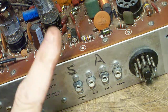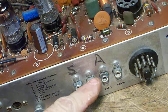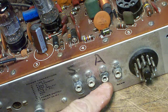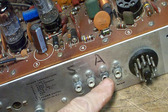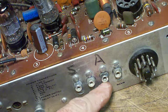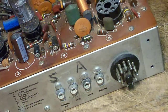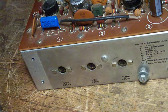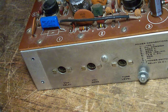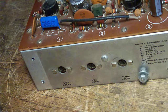Now let's talk about the hookups. You've got your speaker which is an RCA jack, ALC, and antenna — for some reason they decided to put an RCA jack for the antenna, but it works just fine. And this is for an external receiver. Here are some more adjustment controls, and aligning one of these things and getting it on the air is pretty simple. All you have to do is download the Heathkit manual and follow the instructions in the later part of the manual — not a big deal.